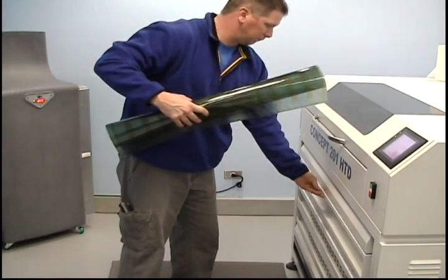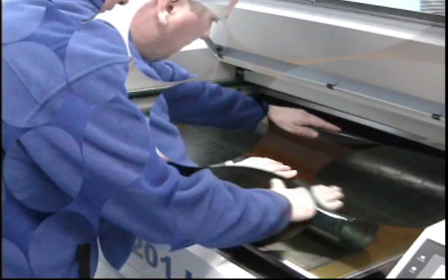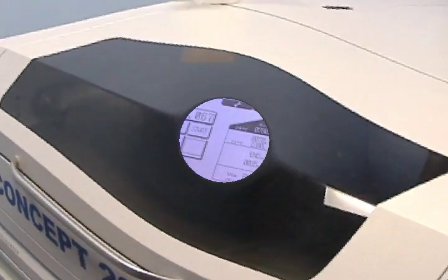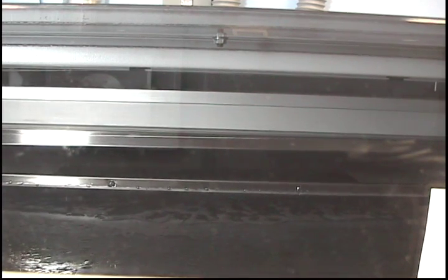The next step is the solvent plate washout. This unit is an all-in-one unit which includes a solvent washout. Some washout systems have a flatbed like this one, others may be rotary, and yet others may pull the plate through a separate washout system. Washout times are established to ensure all unexposed material is removed while minimizing the plate's exposure to solvents. Brushes oscillate back and forth, agitating the solvent over the plate which helps to draw the unexposed plate material away. This used solvent is then reclaimed, removing the solvent particles so the same solvent solution can be used again.